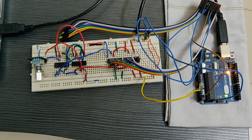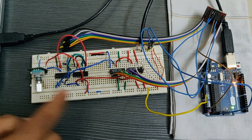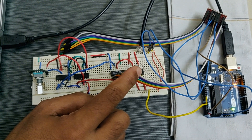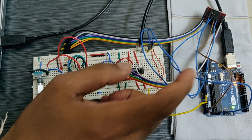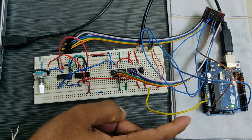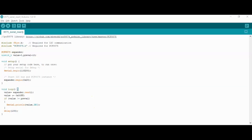Now let's complete the circuit by connecting the remaining two parts. The red wire decides the direction of rotation and the blue wire is the count pulse. I have cascaded two 74191 counter ICs since the encoder has 20 steps per revolution. The 8-bit output from these counters is transferred to Arduino using a PCF8575 I2C module. I have written an Arduino code to see the values from the encoder — let's have a quick look.